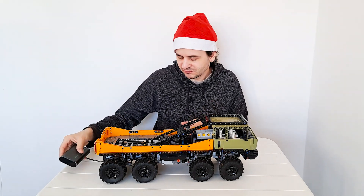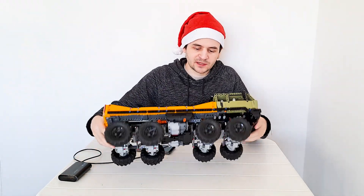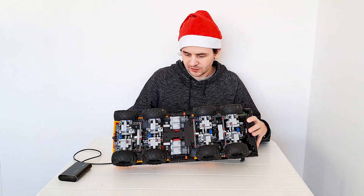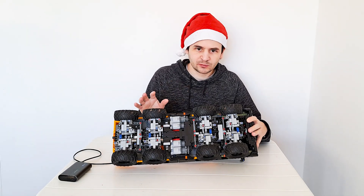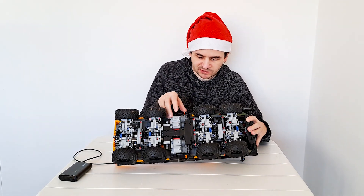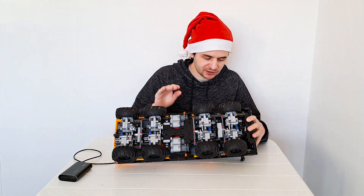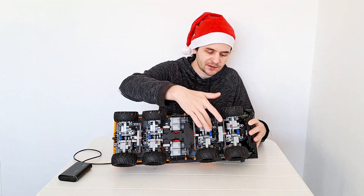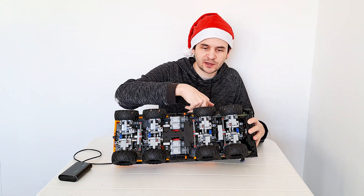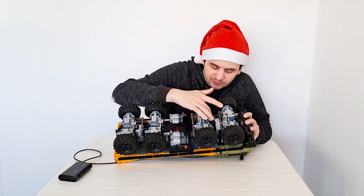Because it's a limited scale, I'm using all-wheel drive without differentials, so all wheels are always driven by all four motors. I'm really happy and proud of the way I managed to make the drivetrain. I'm actually using 22 bevel gears here to transfer the power from the drive axle to the swinging half axles.